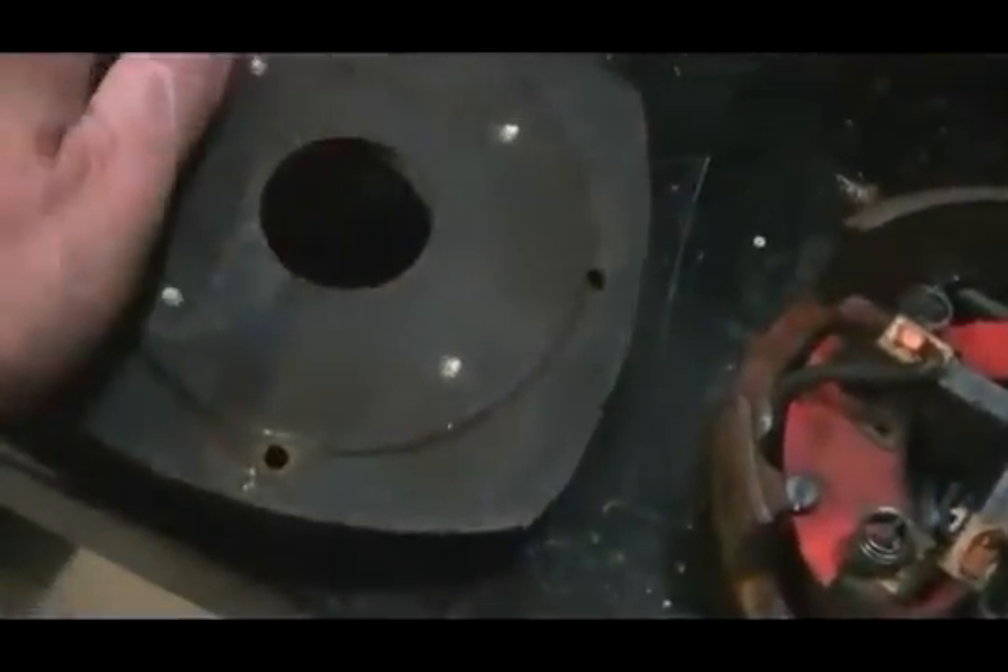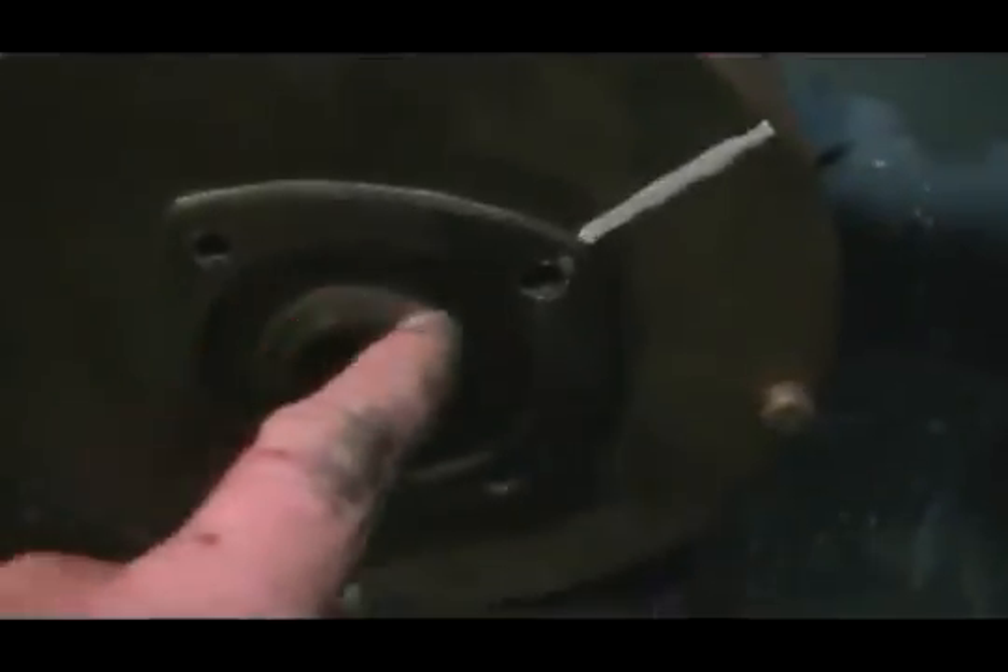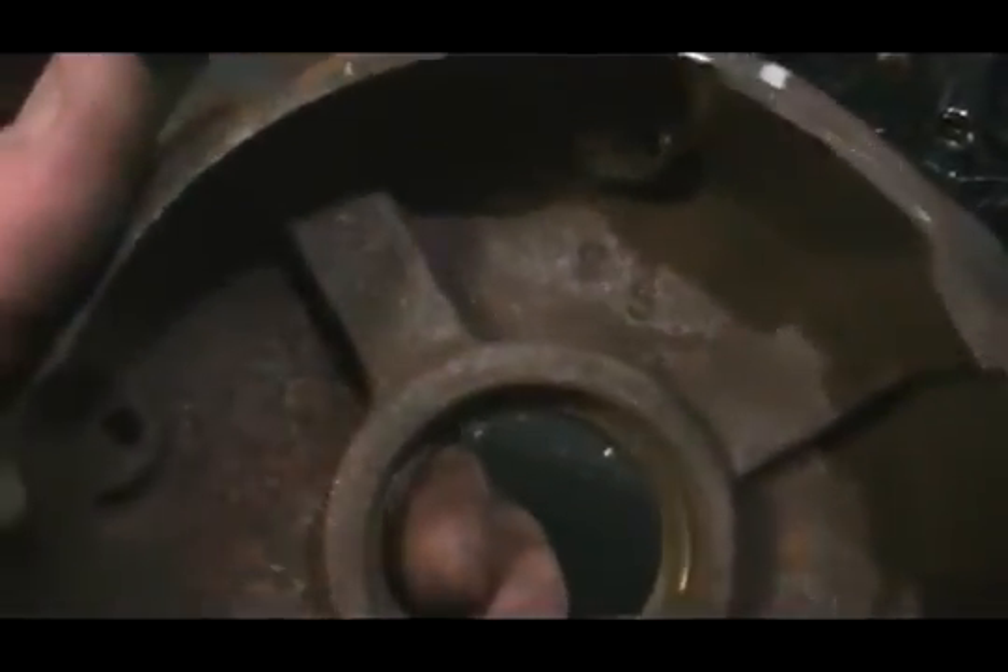The faceplate off the motor - I'll chuck that in the four-jaw, centered it with the bearing housing, and machined this hole out big enough to fit over our boss on the Jenny motor carrier. We have the four holes we must drill and tap. Hopefully I've got them lined up with those ribs there to give us a bit of extra meat on the threads - they look very close, so we'll see how we go. That's where we're at at the moment. The bulk of the drag, like I said, is coming from these four very large brushes.